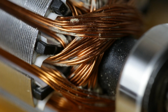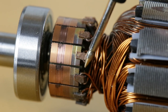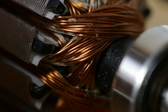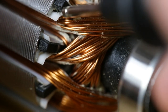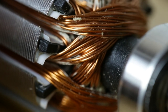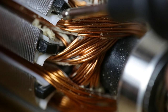While we're talking about the durability of the spindle, I'd like to see varnish on the magnet wire and epoxy where the commutator segments connect to the coil. Right now those connections aren't even soldered — they're just crimped. What's going to happen is that as the copper wires in the armature vibrate as the armature spins, they're going to work-harden over time and eventually snap. That'll be one failure mode, but I think the bearings in this case are probably going to give out first, and at that point it's just worthwhile throwing away the spindle.